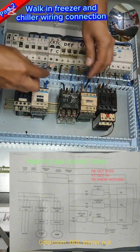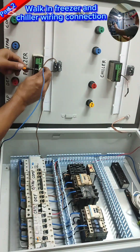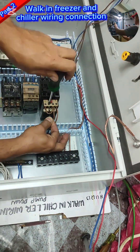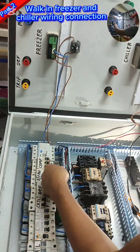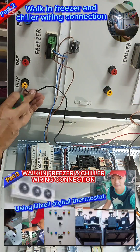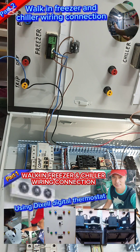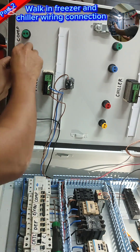The wiring connection is simple — just use a bus bar on top, but because I have different MCBs from three-phase to single-phase to single-pole, I use wires as my bus bar instead. As intended, I wire up the MCB for the freezer compressor to the contactor with overload, then the blower fan with its contactor — the overload I'll take from the existing unit. Then proceed to the other contactor with MCB as well. We are now wiring up the compressor contactor to the Dixel control. I made a series of videos prior to the installation of this control panel box for a dual freezer and chiller where I discussed how to wire the freezer side — and here is the reality now.